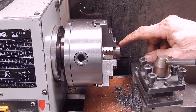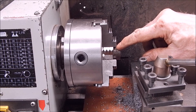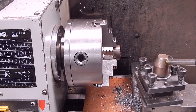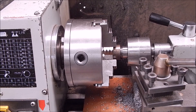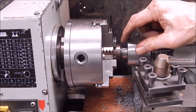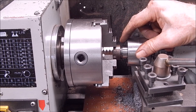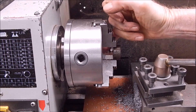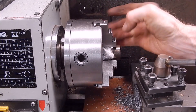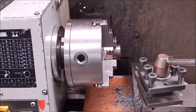Here's a tip for you - if you're ever parting off short pieces like this, that's steel too, just gripping it on the end of the jaws. Use your tailstock with a live center in it, or a pipe center if it's a bigger diameter thing. And that will steady it, you won't have any problems whatsoever. Also, when you're machining tubular like this, put some dunny paper up the center of your chuck, and that will stop all the crap, or most of the crap, from getting into the scroll and screwing things around. So there's a couple of tips for you. All right, moving on.